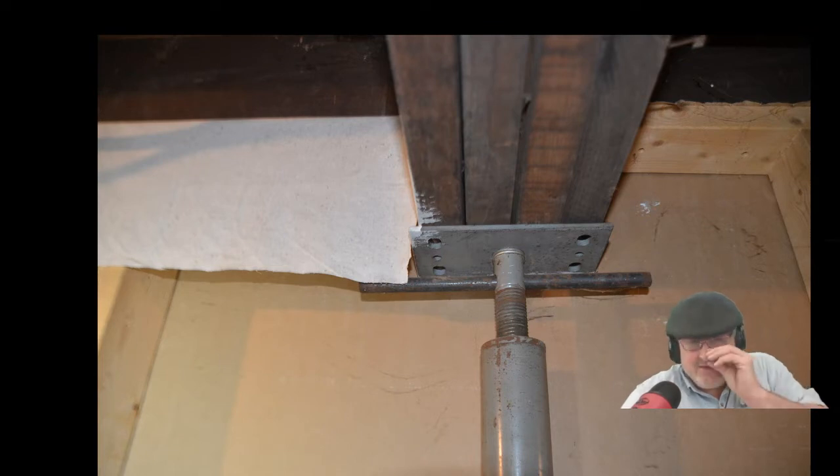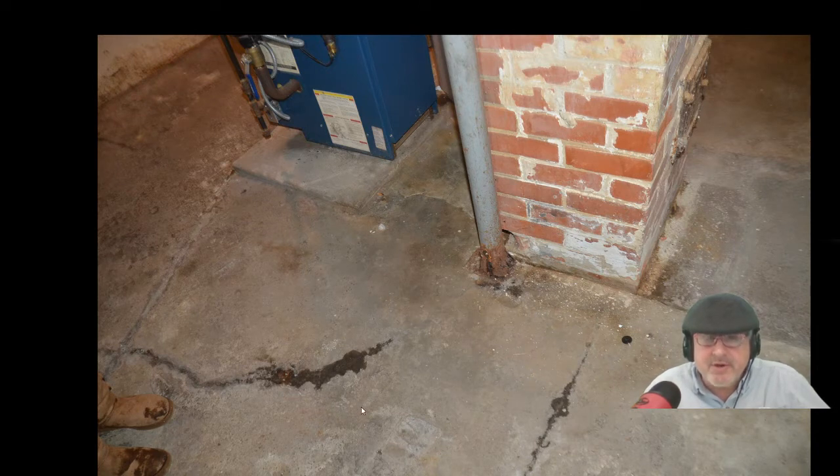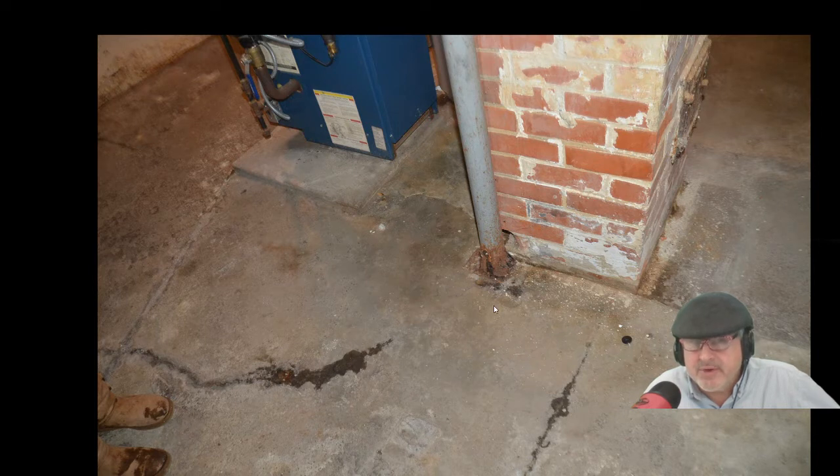You want to fasten your columns to the bottoms of the beams — you could add a couple of lag bolts. This column is holding up a beam in the center of the house, and you can see it deteriorated with moisture coming through the floor — that's hydrostatic loading. Moisture comes up underground from hydrostatic pressure as houses get older and rusts these columns out. The whole column starts to compress, and then upstairs in the kitchen you can't figure out why your stove isn't level. So check these out: put a couple supports in, take the old one out, cut the floor, make sure there's a footer. If there isn't, pour yourself a footer — one foot by one foot below the slab.